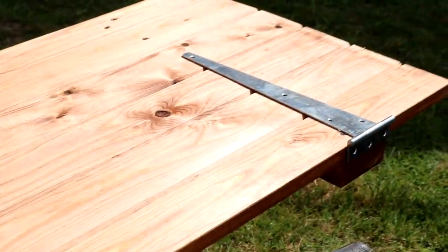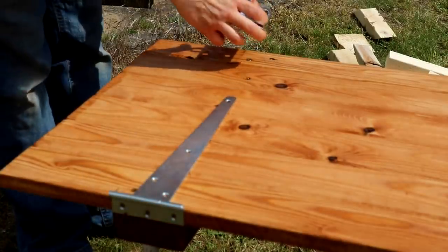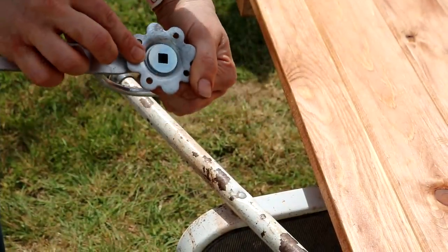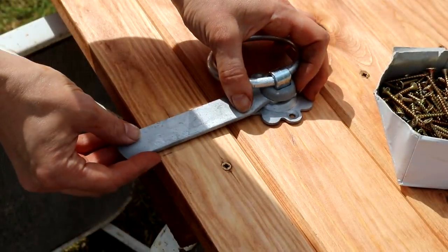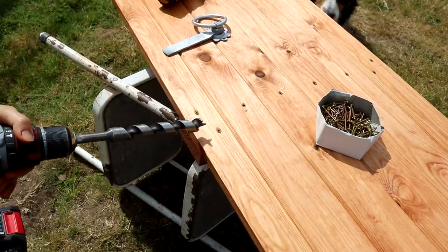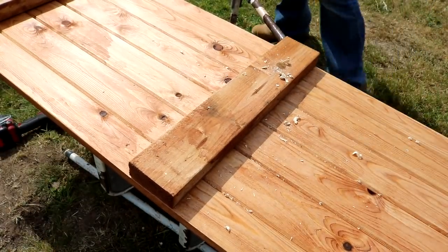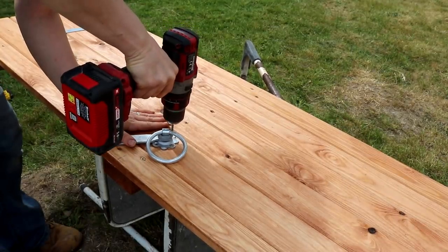For the hinges, I'm using these from a set — I'll try and leave links to everything in the description box. I positioned them on the top and bottom spar, with the bolt next to the top one, and screwed them to the gate. Then to add the latch, I needed to drill a hole for the bar to slot through. It's going on the middle spar but overhanging it by about an inch. I moved it down slightly to draw a mark roughly where the handle hole lies and screwed the latch to the door, which conveniently allowed me to move it out of the way to add more screws.